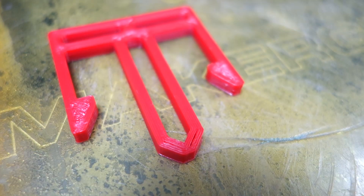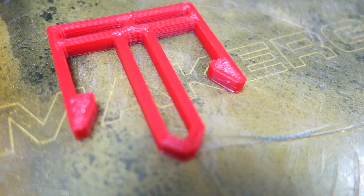Although this can be very frustrating for the designer, there is a way around it. The solution is actually really simple: design and 3D print the parts so that the snap hooks are printed on their sides. This will make sure that the bending forces are distributed along the layers instead of between the layers. To demonstrate this, let's look at a simplified snap fit joint.